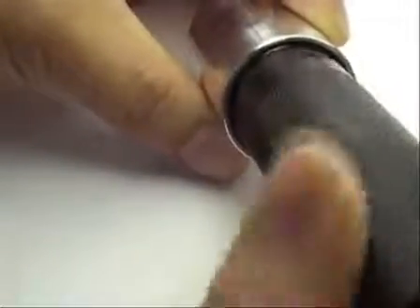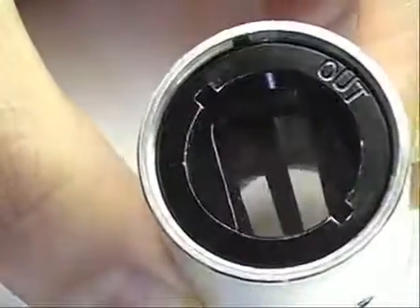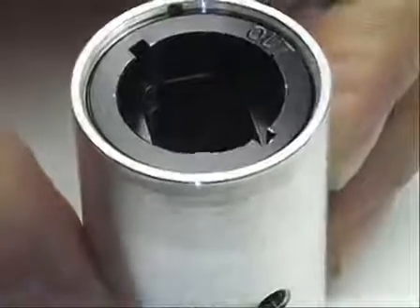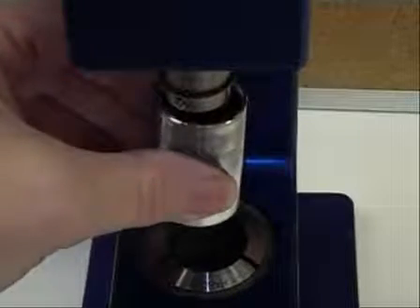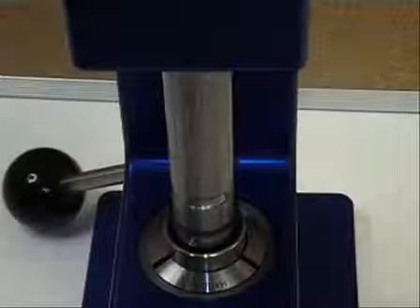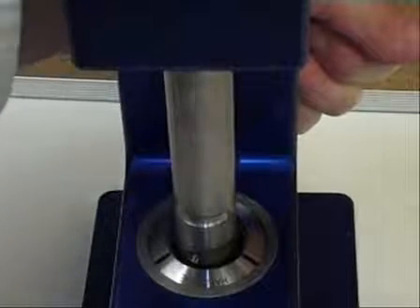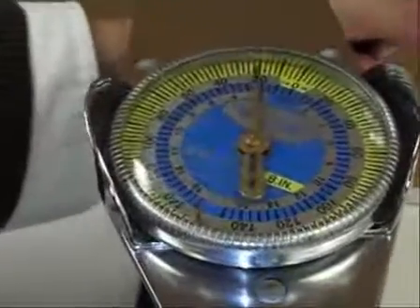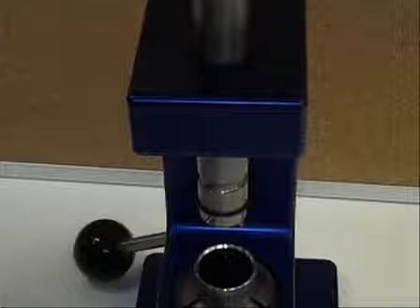Now is a good time to look inside the cell for dust, lint, and fingerprints. You will also notice Newton's rings, which indicate there is still air between the centerpiece and the windows — these will disappear after torquing. With the screw ring up and the word OUT visible, place the sample cell all the way down inside the cell torque collet of the torque stand. Hold the cell in place by applying constant pressure on the torque stand handle. In one continuous motion, torque the screw ring to between 120 and 140 inch-pounds. Then release the handle and carefully remove the sample cell.